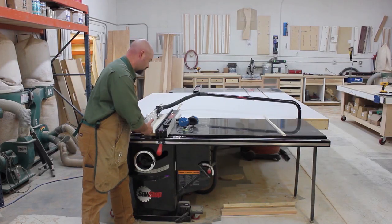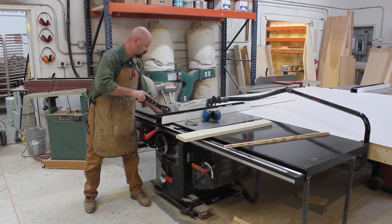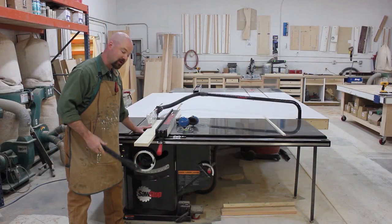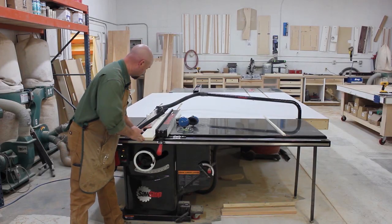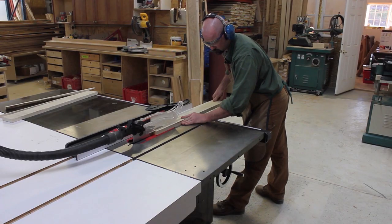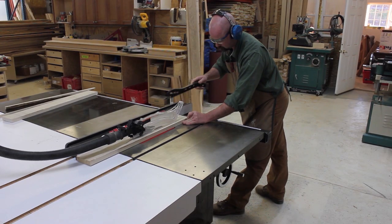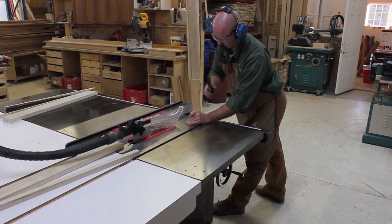When the board is fully supported on the table saw, I can grab the push stick and follow right through. I don't want to push down on the board when it's still out here — there's nothing underneath there to support it. When I have solid support, then I can get the push stick on there and follow through. Notice that my left hand is controlling the workpiece and not moving at all, while my right hand is propelling the workpiece. Both hands have specific operations that they have to undertake.